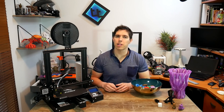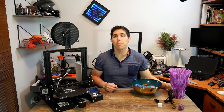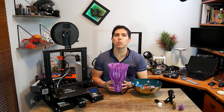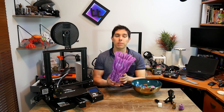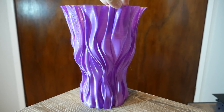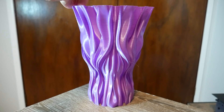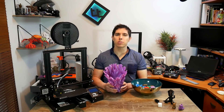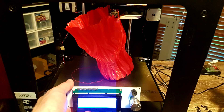I'm using the same Simplify3D profile I posted in a previous video on how to tune your slicer. Next I printed a vase in vase mode — the first time I've printed at the full 250mm height the printer can do. It turned out pretty nicely but I had the speed a little too high at 90mm/s, which caused some bumpy bits from vibration, reducing the final surface quality slightly. I also ran this print side by side with my Frankendoodle, which printed well until the end where it came loose and melted itself to the hot end.